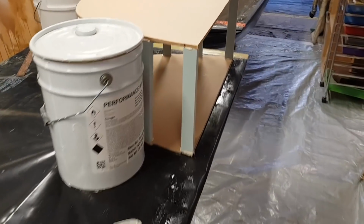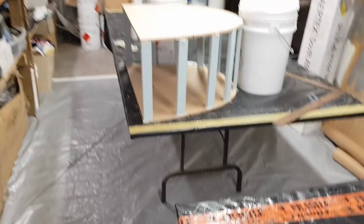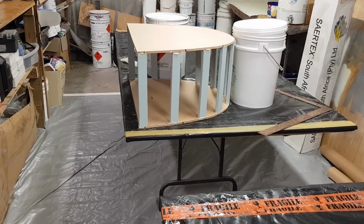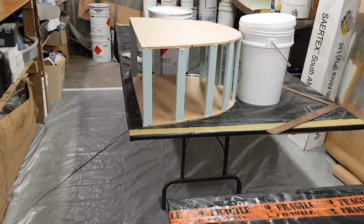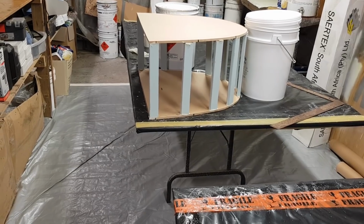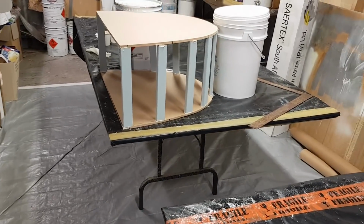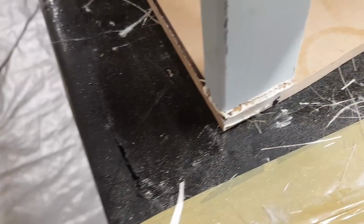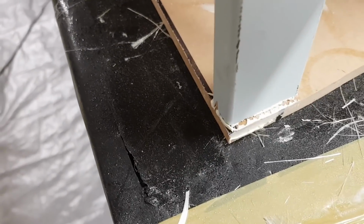It was a bit touch and go there because it was going to fall over and that would have been an absolute disaster, but pretty much that's the outside of the mould there, and then I'm going to place that very thin fiberglass layer on it, and then we can derive the inside of the Blackwater tank from this particular mould. So you'll notice here I've actually inset it about 2 millimeters.